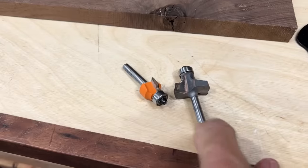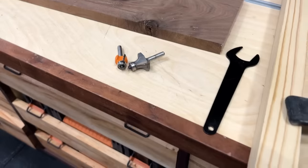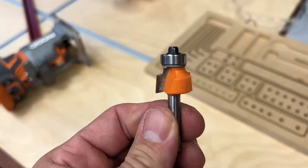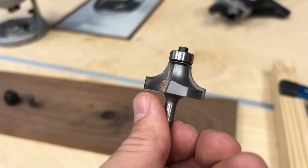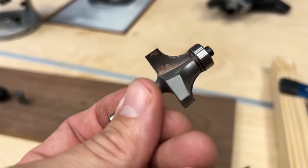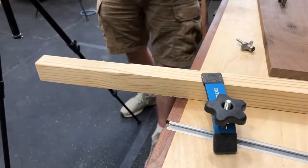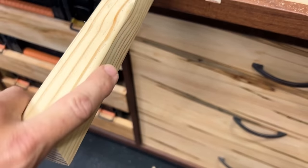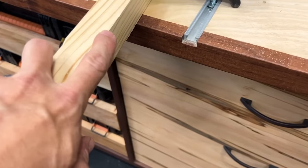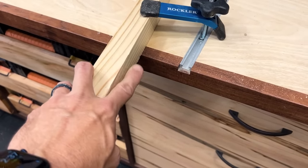I'll put links in the description below to the ones I like. If you're wanting to just take the sharp edge off of something like a cutting board, a tray, or a tabletop, the 1/8 inch round over is excellent for that. This is a square piece of wood with really sharp edges on it. As you can see, it just put a very small rounded over edge — that gives it a nice smooth edge and a finished feel. As you're building furniture and you leave that sharp edge, it's going to cut people or it's going to splinter on you later. This is a good way just to finish that up.